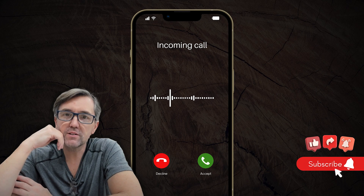The question of whether a hinge will work on a particular door thickness is related to the size. When it's an inch and three-eighths door, the rule is three and a half inch.